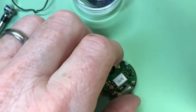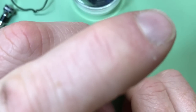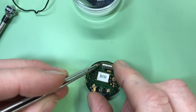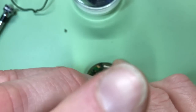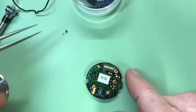We'll try and remove the module with the screws I can see, then put it on the microscope and have a look at the extent of the battery leak damage - whether it's extensive or whether it's just stayed in the battery compartment, and whether it's damaged any of the board. I'm doing this very much on the fly because I haven't gone this far into this watch.